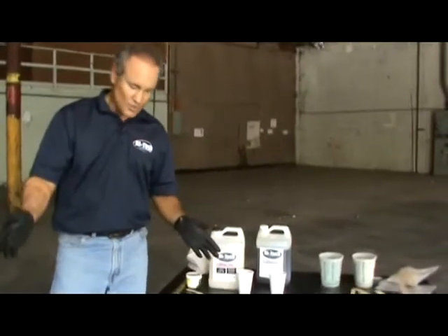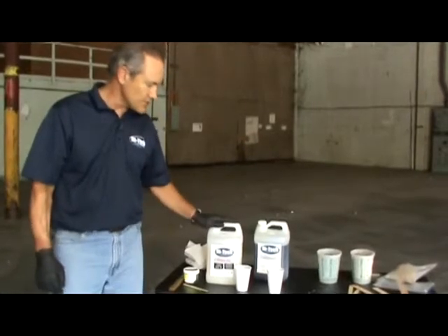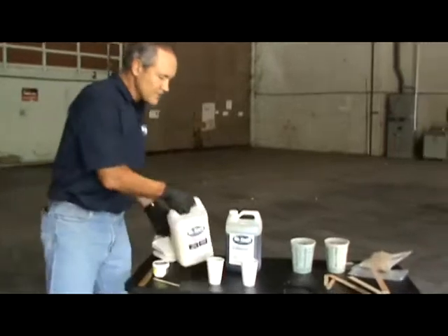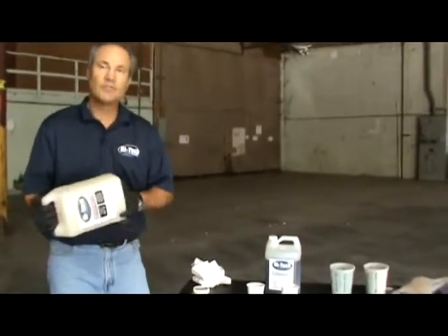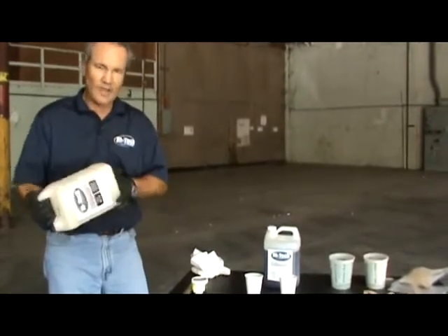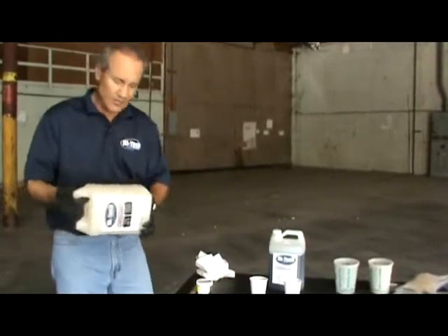Now that we've opened up this joint and cut the big spots with our hand grinder, we're going to use our TX3 to repair it with some sand. We can send out the TX3 B-side untinted. It's very important that you shake it and blend it first before you add the pigment. You want to shake it for about 20 to 25 seconds or so, making sure all the poly B-side is nice and blended throughout.